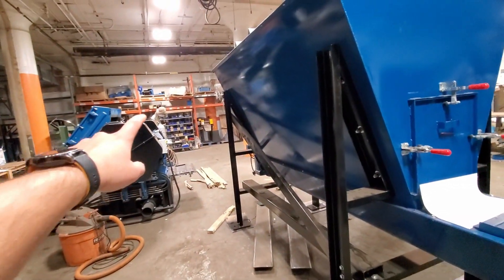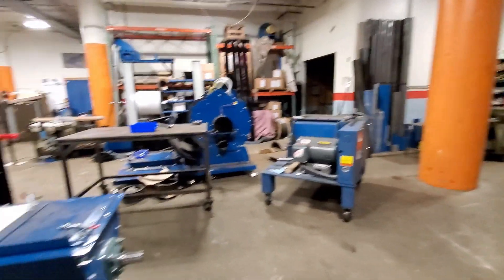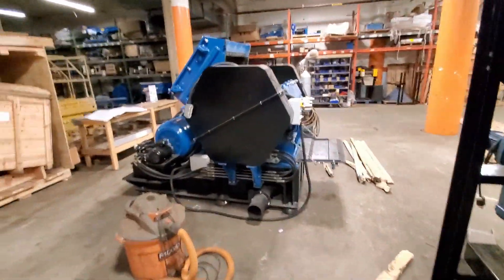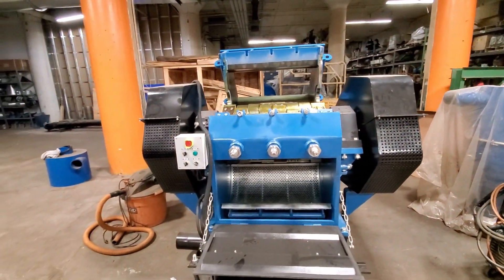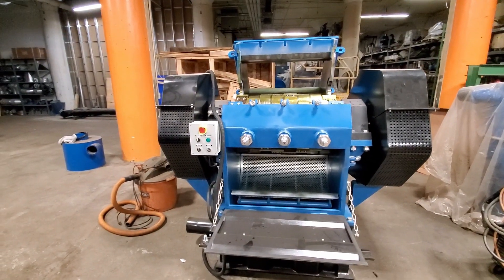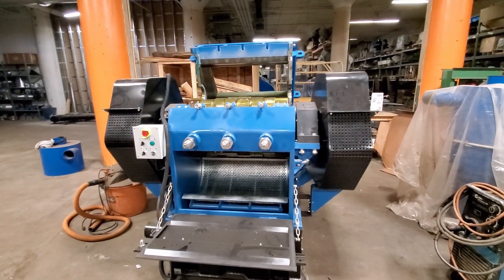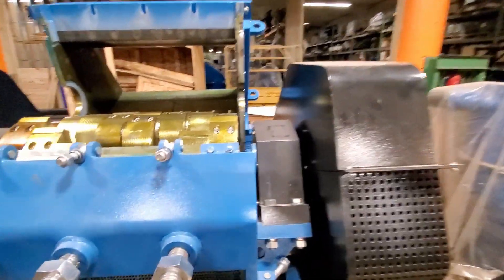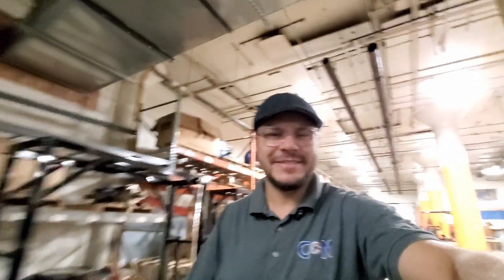This new unit has a solid flywheel and solid pulley. The older-style unit does not have the solid flywheel — it just has a pulley. That's why we really like this staggered-tooth style — it's a really robust granulator. If you're not doing super low grades, this is what I'd recommend as a first pass, and then from here into a zigzag and a turbo, or just through a turbo, depending on what type of material you're running. You can even see the bearings — everything is just really massive and solid, big bearings. It's a good unit. Like, comment, subscribe. If you have any questions, post them in the comments or feel free to reach out to us directly. Happy Friday — we'll catch you in the next one.